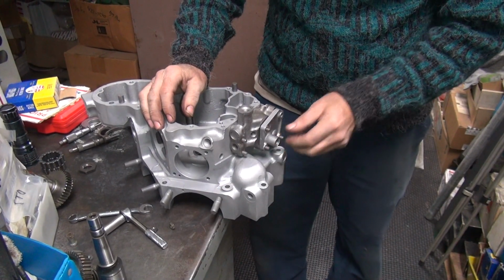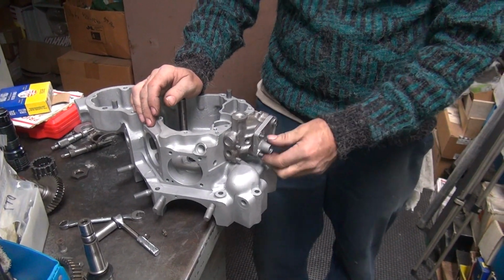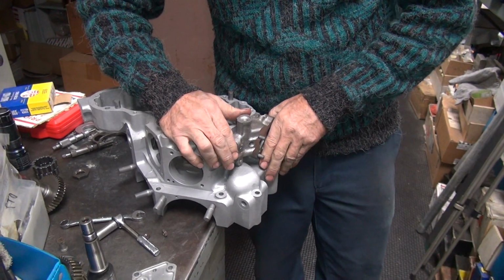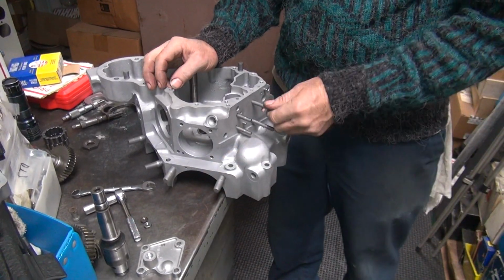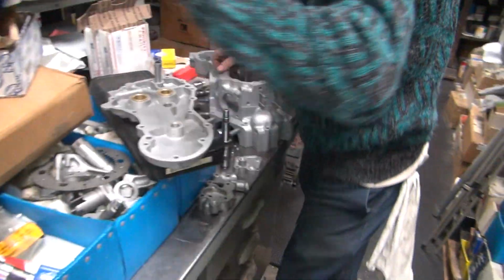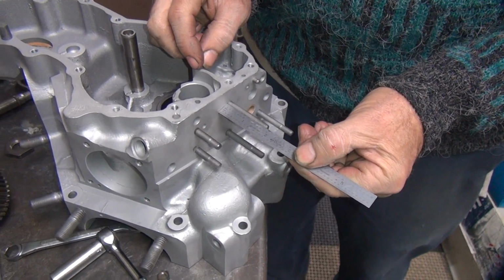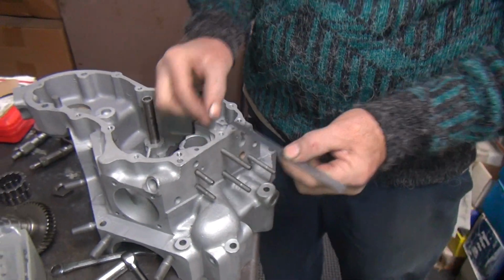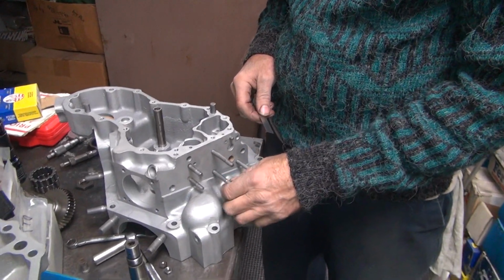Okay, so now things look pretty equal. A lot better than it did. Looked like crap before. So now we need a stud. How long of a stud do you need? We need 1 3/4 plus how much? About maybe there. So we need about a 2 1/4 inch stud. Got a 2 1/4 inch stud laying around? Personally, I do not.